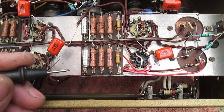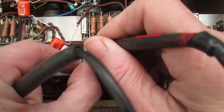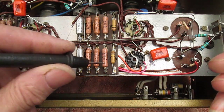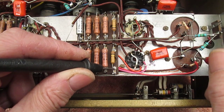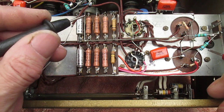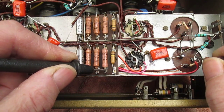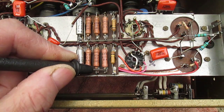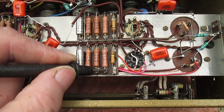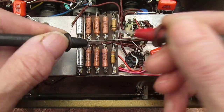So let's have a buzzing out of all the connections to make sure I haven't screwed up. So somebody's been in and knocked that one and spilled its loveliness. Right, that one, if I remember rightly, should go to HT. No, other way. Ah, right, well, it helps if you turn the meter on. Right, where are we? 8K2, and hold on, that's 82. Is that 82M? No, 8.2k, which drops the voltage to there, so that should be there, and then that should be our anode.